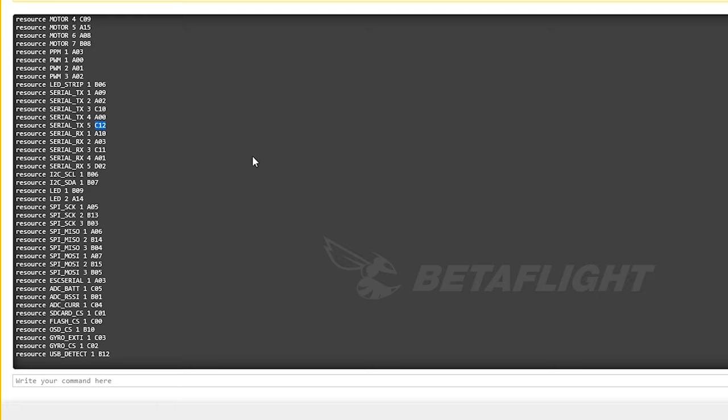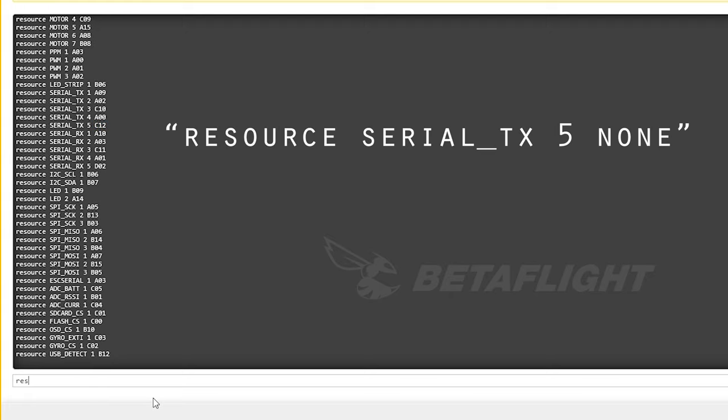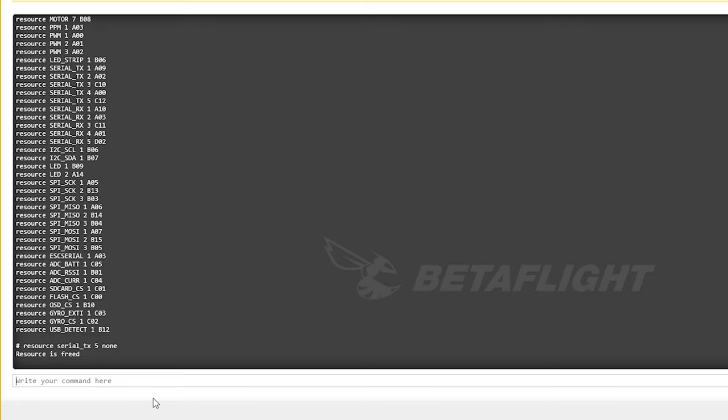That is very important, so I would honestly write that down. You're gonna come down to the command line again, and you're gonna type resource space serial underscore TX, whatever yours is, space none, and hit enter. You'll see a resource is freed here.